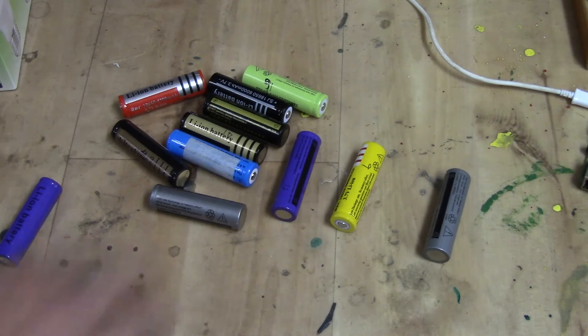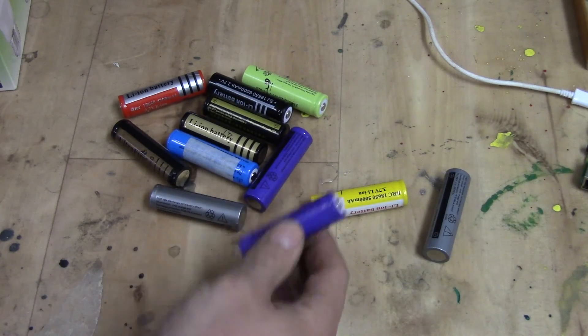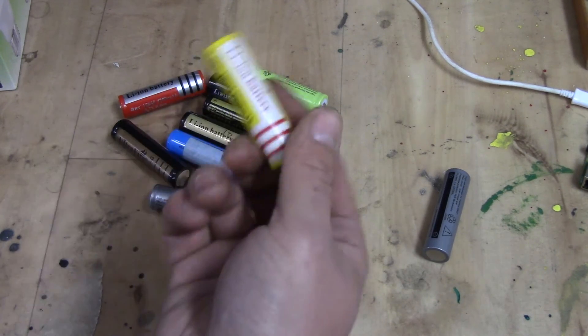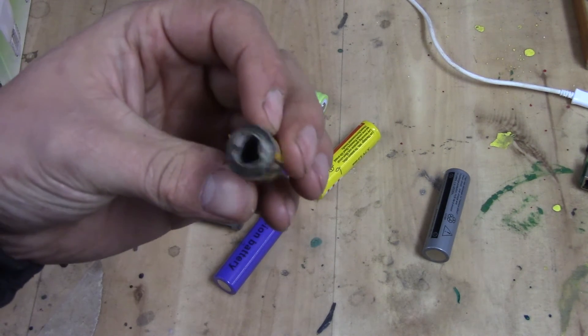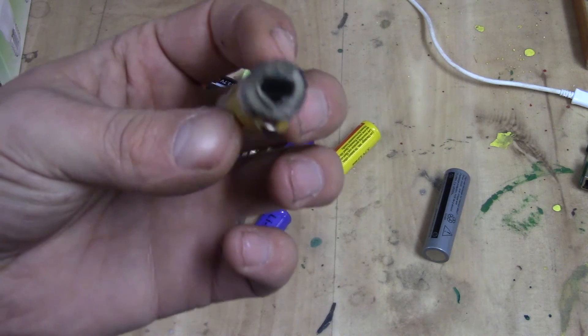We had one good cell, except for two of the cells that I bought before that were better. They don't contain what they should. They don't contain the protective circuitry that they should either. I'm not going to do any further tests on them because that's not useful, and I also think that you guys have gotten the information that you need. Are they genuine or not? No, they aren't. Do they perform good enough to work with? No, they don't. They perform roughly 500 mAh compared to what they should, or 2 Ah that most of you want. And when looking at the inside, we understand why they only perform one quarter — because they only contain one quarter of the content they need to perform.